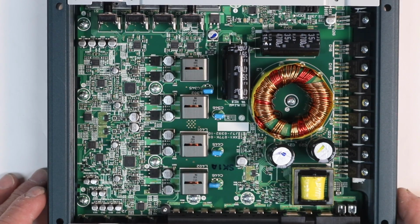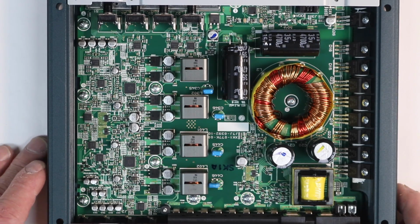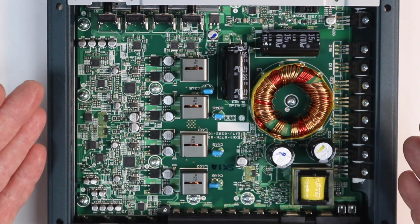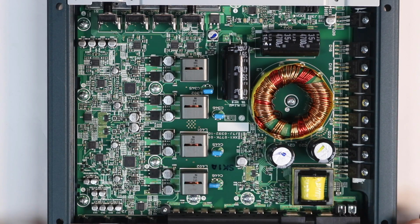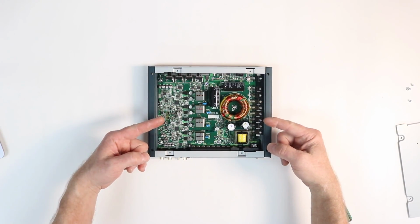Looking deep into the amplifier, we can see the high performance parts. Special capacitors and inductors have been carefully selected. The digital amplifier's LC filter, which is essential for achieving high resolution audio. These high quality performance parts reduce noise and distortion to ensure excellent sound quality. And there you have it. These guys here are for filtering for your FM signal, but here is the inside. Enjoy. All that done, let's head over to the amp dyno and see what these things do in the real world.